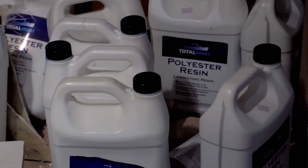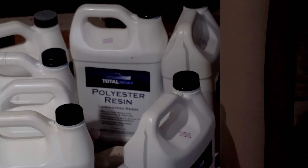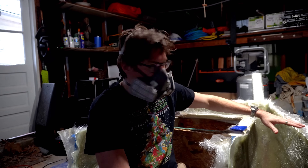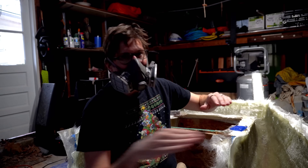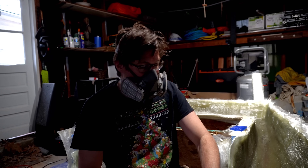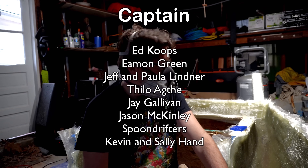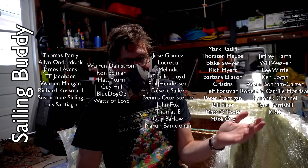This is going to cure, and then next time I'll sand it again and put another layer of cloth on — the process repeats itself. When we finally have it thick enough, we pop it out. All these loose bits up here that look ratty are excess overhang — when I take it out I'll cut that off and it'll be a nice crisp edge. It's a very time-consuming process; this one layer went pretty quick at three hours. Normally they take me four to five hours, but I'm getting more practice and know where the cloth needs to go.